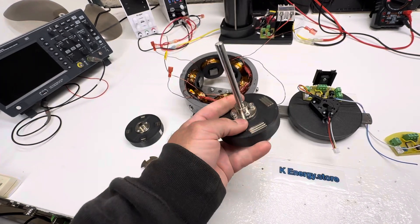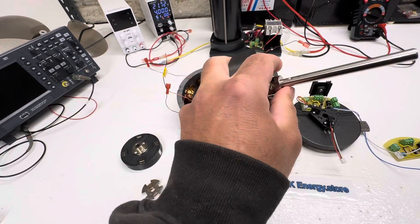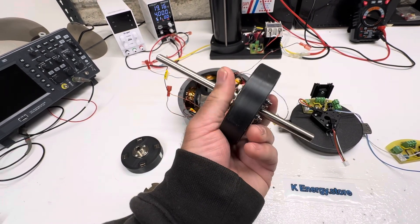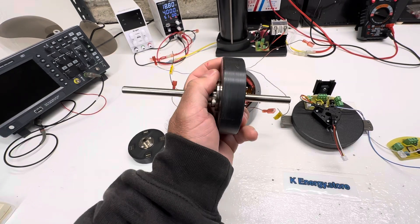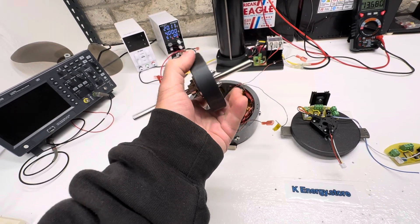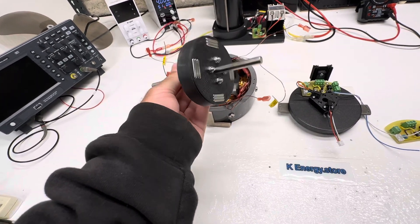This hub is really cool — we get these on Amazon. I just drill a little set screw hole on both sides of the shaft so the set screws sit in there real nice. Then I put it on the lathe to smooth it all out and make sure there are no imperfections on the outside, which makes it spin a lot smoother.